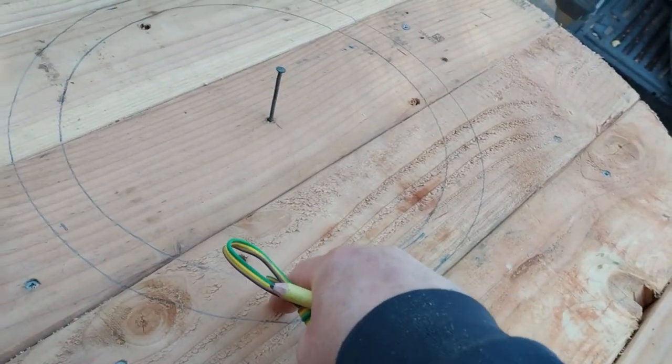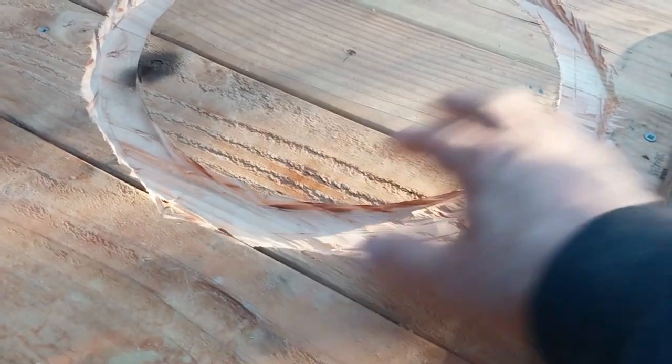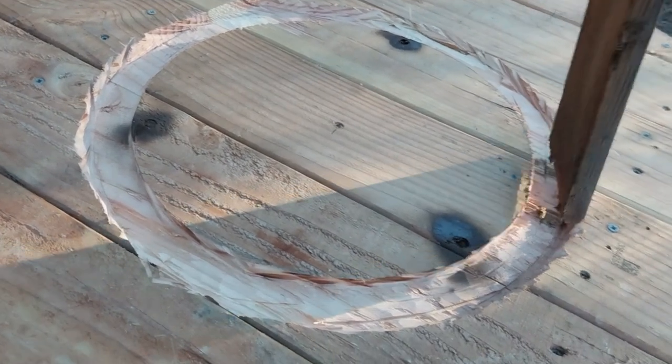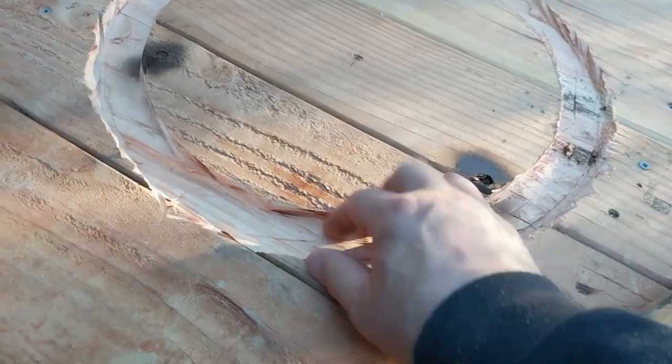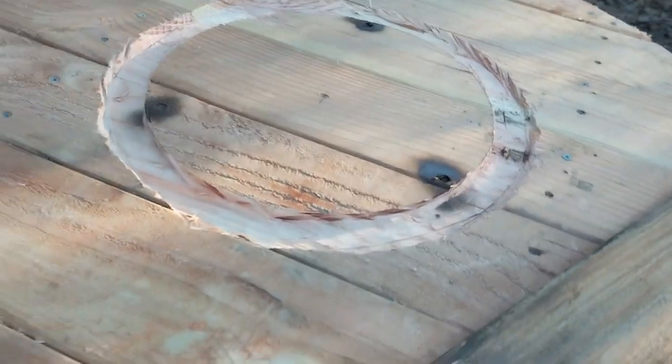Now I need to cut into it. All right, you kind of see I did it. It's kind of wobbled, whatever you want to call it. But there's a groove cut, and it's enough to keep these from kicking in and out. Okay, so we're good. I was really trying to make it smaller, but I used my skill saw, dropped it down to 3/8 deep and just kept right on going, and then I used the hand chisel and chiseled out those spots. So there we go.